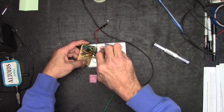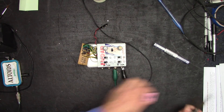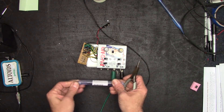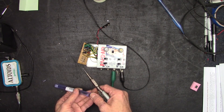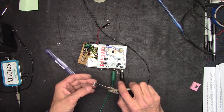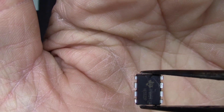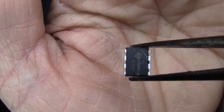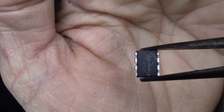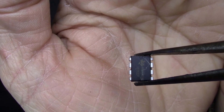I've got a piece of anti-static foam to put the chip on. I'm just going to grab the old one, pull it out, put it aside on that foam. Now let's grab a new one. There's a little dimple on the end near the Texas Instruments logo — that looks like the state of Texas — and to the left of that dimple is pin 1.